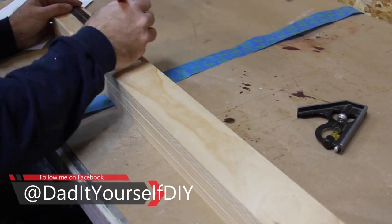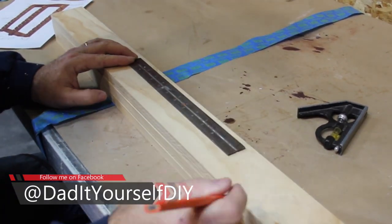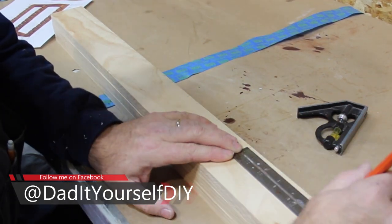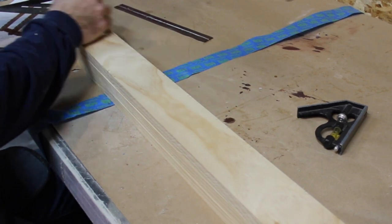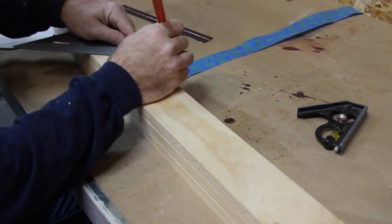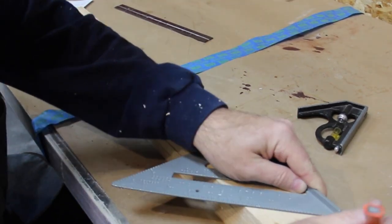These 3 34-inch boards make up the vertical members of the display. I secured them together with two-sided tape, but if you don't have two-sided tape, you can use CA glue and painter's tape. There's a bunch of videos here on YouTube that demonstrate this method. The reason I'm taping them together is it aligns everything and I'll have symmetrical holes and cuts.